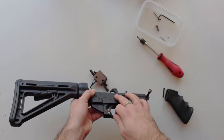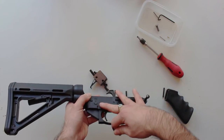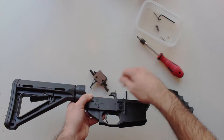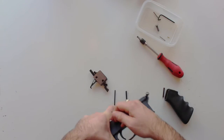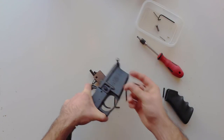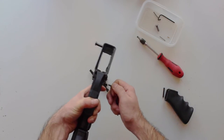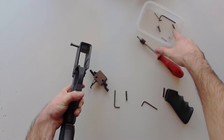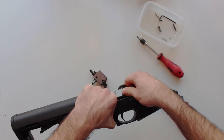The next thing is to remove the old trigger so you can get the safety out and the new trigger unit in. To get the old trigger out you need to remove these two pins. If you've got the original Smith & Wesson 1522 trigger, it's in two parts, so you can't just whack it out — you need to do it safely and calmly, one bit at a time. Hold it in place because there's a big spring in there and it will just fly out. Keep your finger over it and push the pin through with the allen key that comes with the new trigger.